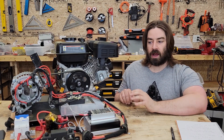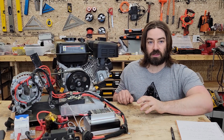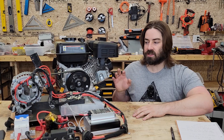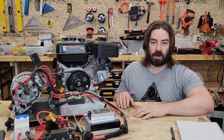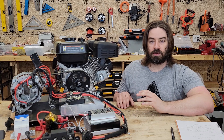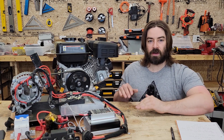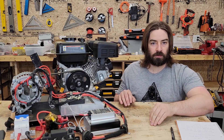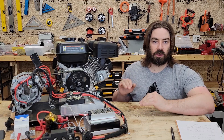At this point I have a choice. I could rearrange my full bridge rectifiers into a series configuration to get more voltage, but I just don't like running this engine at 2600 RPM — it's vibrating too much. So I'm going to move up the RPMs and try to find some kind of sweet spot where I can still pull 40 amps from the alternator but run the engine at its lowest possible RPM.